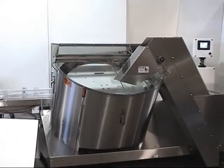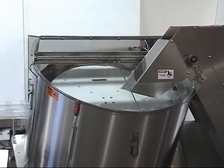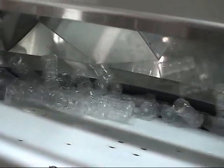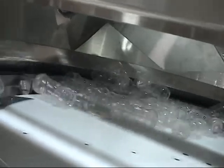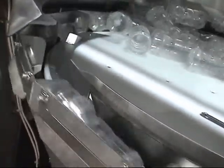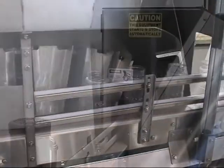The machine consists of a hopper with a stationary floor that is inclined at a 30 degree angle. Around the outside edge of the floor is a series of moving pockets or chutes, which will accept your bottle and carry it to the high side of the hopper. At this point, the bottle is oriented bottom down and placed in a chute to be discharged on a built-in and synchronized conveyor.